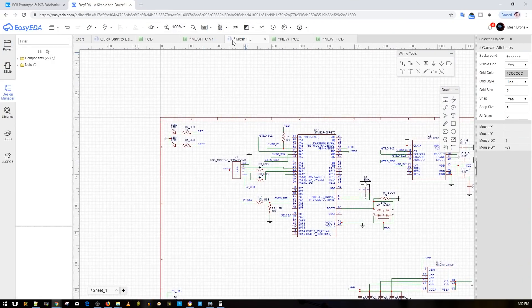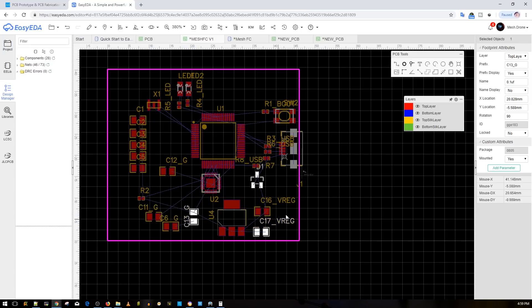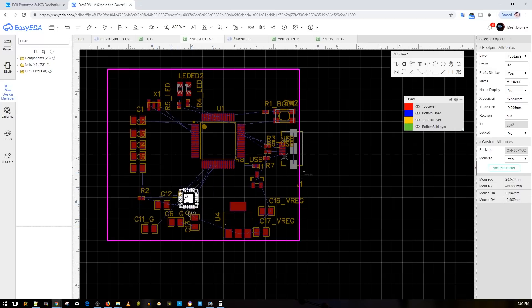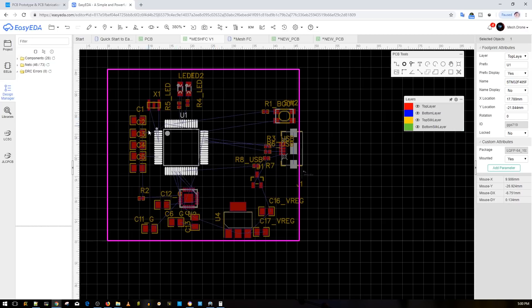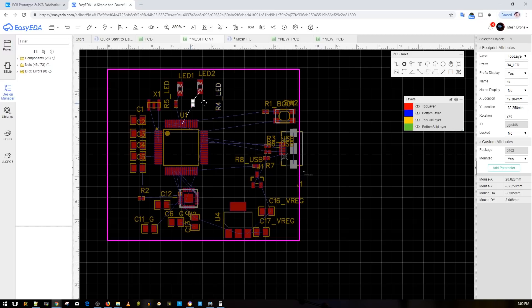Once I start building this series it'll all make a lot of sense. The boot button needs its own resistor — R1 boot. The LED resistors limit current to the LEDs. On the PCB you just route traces like a wire — I'll show how to do that on future slides. These components are 0402 size. I'm also debating whether to include a 5V regulator before manufacturing or expose all MCU pin breakouts instead.